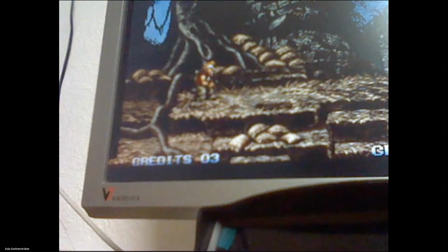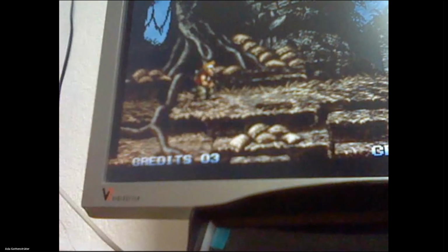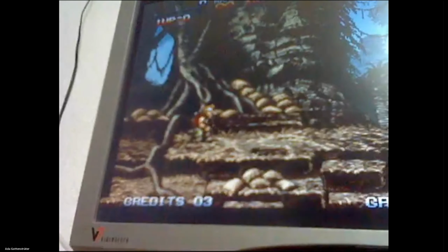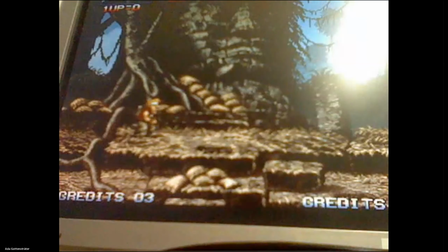And of course, in analog magic world, you can actually do line multiplication without increasing the horizontal pixel count. So that's what this is doing. It's useful because it is cool. This is 320 by 240 in the virtual resolution, but on the monitor, this is actually something like 960 by 720. What it simply does is repeat every line 3 times, but it doesn't actually have to double up or triple up the pixels, because it can just use a lower pixel clock.